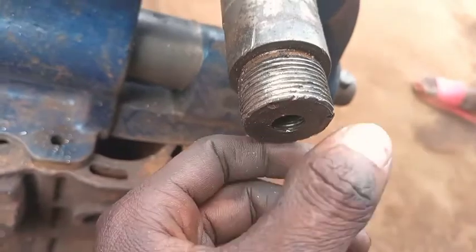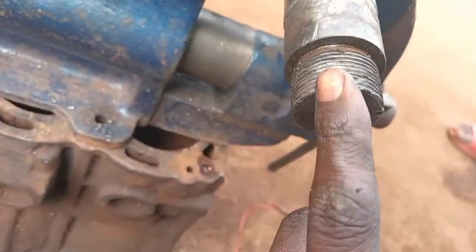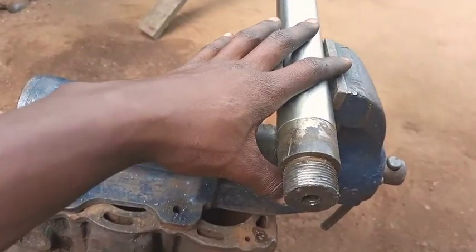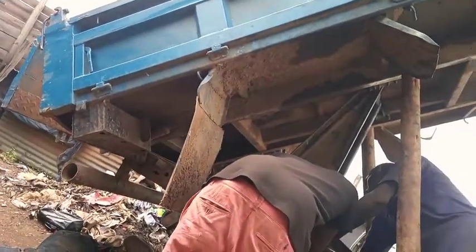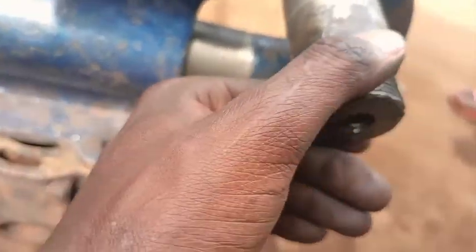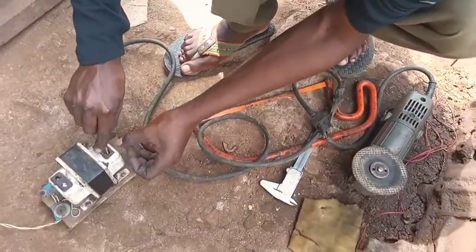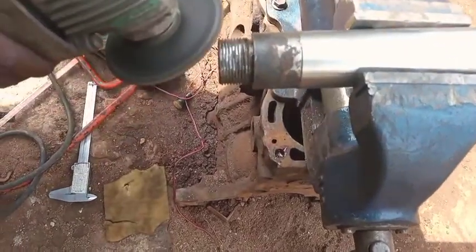Because they knocked it, it's a bit big. So I'm going to bring a grinder and grind here, because it may be hard for this bolt to tie inside. This pipe ties inside a jack of a tipper. This is the bolt which ties inside. Let me grind this part a bit more so that it can get a starting point - I'm going to use a grinder to put that starting point.